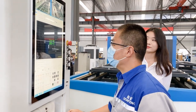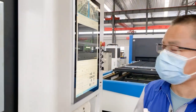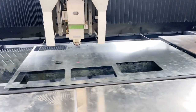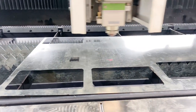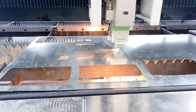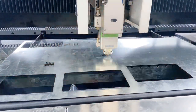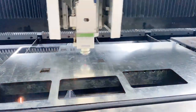Let's cut. We're starting with one millimeter material and cutting in this area. All of these small circles — we are using sliding cutting, also called scanning cutting. It is very fast. The head never lifts up, only keeps moving and keeps blowing nitrogen.